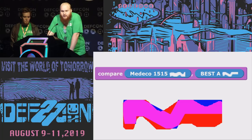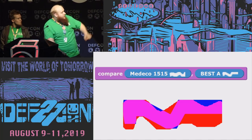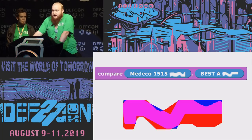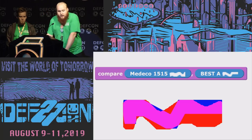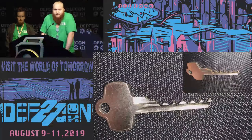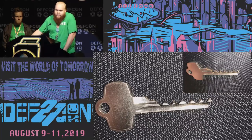So let's apply this to actually create restricted keys. We see here the Medeco 1515, that's what's shown in red there. That's a restricted keyway, that's for Medeco Classic, you're not supposed to be able to buy those anywhere. But you can buy a Best A anywhere, the most common Best keyway out there. If you look at this comparison here, you'll see that they're the same in the bottom half of the keyway. Well, what sort of key only uses the bottom half? A bump key. So we can take that Best A and cut it to be a Medeco bump key, otherwise completely unmodified in terms of the keyway, and that's going to enter that Medeco lock and function as a bump key.